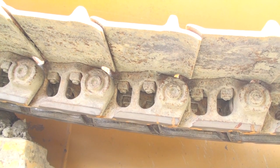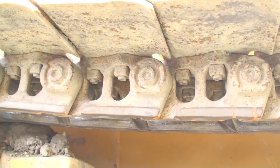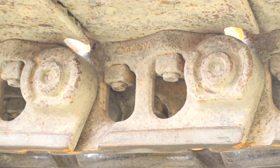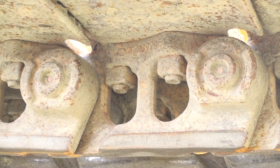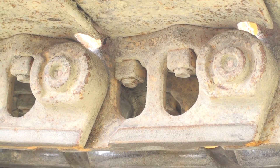Let's start with the basics of an oval track dozer undercarriage. When I approach a crawler tractor for inspection, the first information I want to know is if the track chains are sealed and lubricated. What I look for is a rubber plug in one end of the track pins. All sealed and lubricated track chains have that plug.